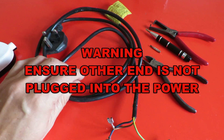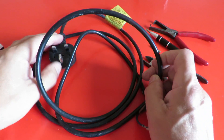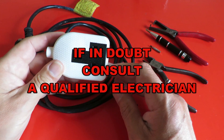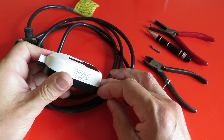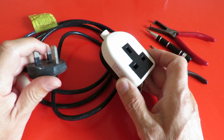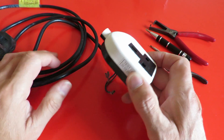This is the power cord off of something that I've taken apart quite a while ago and haven't used, but I now need a short extension lead — just a single one-way extension lead. So I've actually bought this trailing lead adapter in Wilco for £1.25 and I'm going to put it on the end of here. You have to be a bit careful when you're reusing electrical items — make sure they're rated for what you want to use them for. This one's got a 13 amp fuse in it, so that's going to be plenty for what I'm going to be using it for.